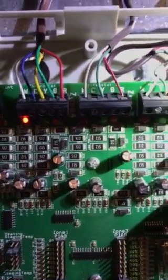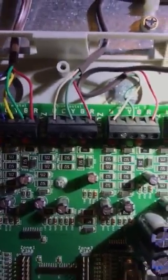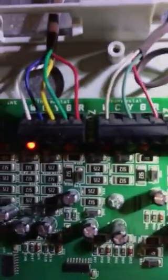This is the Lennox Harmony 3 board. Here on thermostat number four, it's got a place for five wires that has that common — the C — that none of the other thermostats had been using. So I decided to go with this five-conductor wire and use that C wire, which is the 24-volt return power, and I'm still using the RH on the Nest, which is this R here. I'm really having great luck with that working with this thermostat.